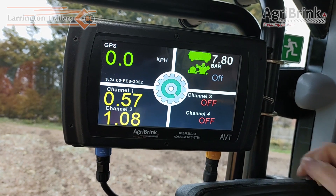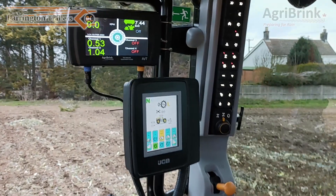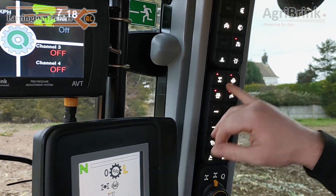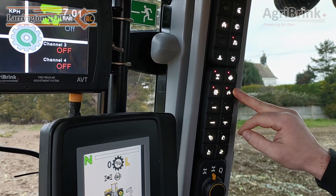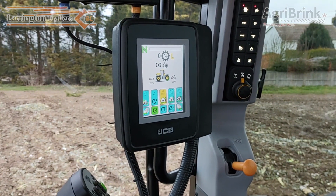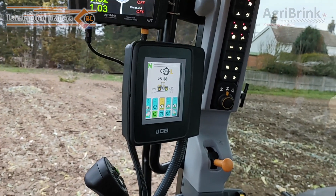And you'll be able to see how fast — that's how fast we can let the air out of the four tyres. Peter, just give us a quick rundown on how we've set the tractor. So we've set the tractor up with four wheel drive and diff lock. We also have some cut-outs put in, so when we lift the arms up the diff comes out. We've also engaged slip control, set at about 15% slip — so if the tractor sees 15% slip, it'll adjust the implements accordingly and maintain optimum traction. Peter's going to do a run across the field and we'll see how it goes.